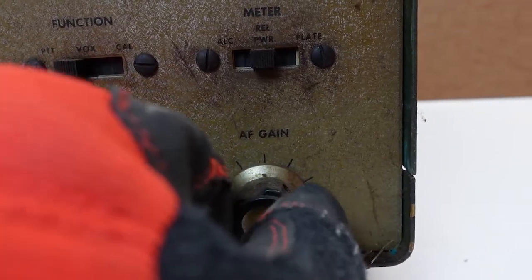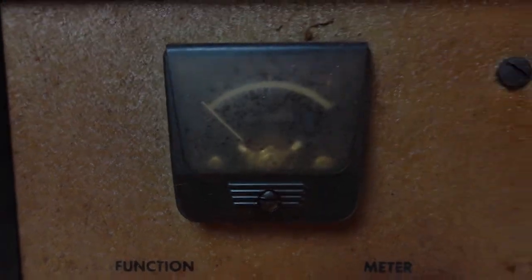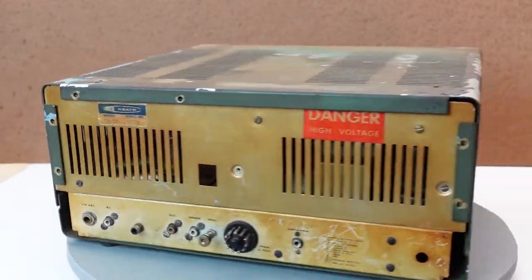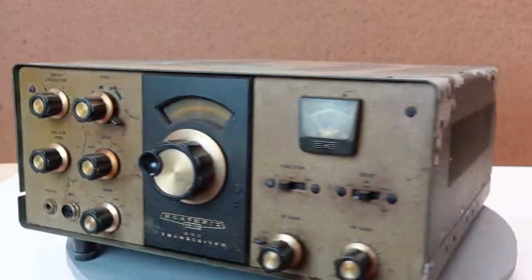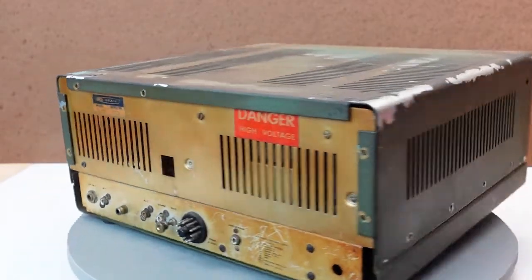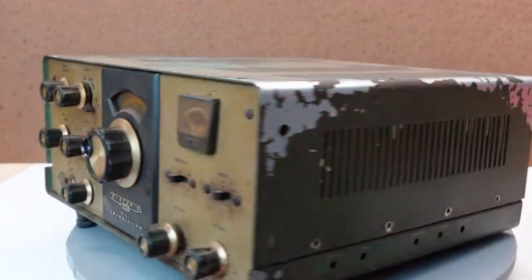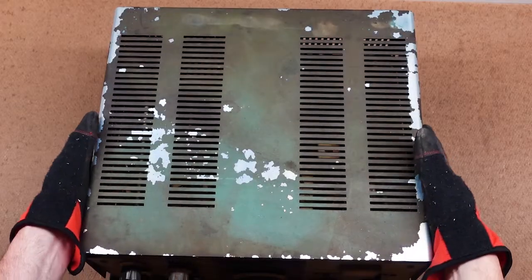The rest are potentiometers or variable caps or simpler switches. And of course, the meter is almost completely opaque too. Rounding out the rest of the exterior assessment, the paint's coming off over large areas on the top cover. So that's a tricky issue in restoration, because getting even a close color and texture match to the Heathkit factory paint would be a big challenge. But at least all the rear jacks and connectors look to be intact. Let's have a look under the lid.